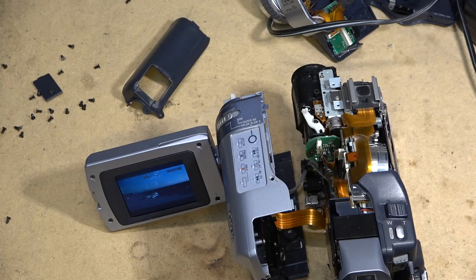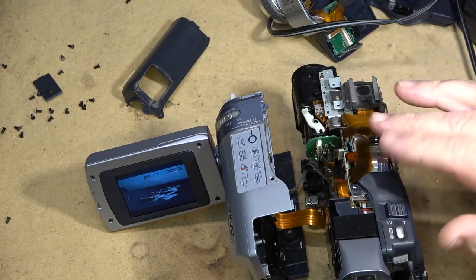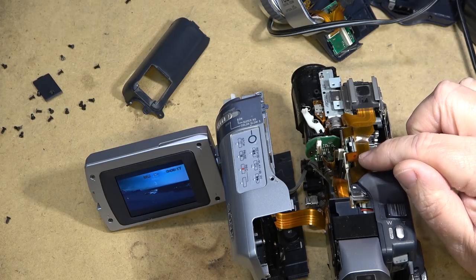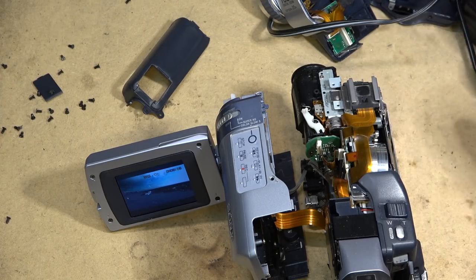And I thought the ones that I have with the little flap that flipped open on the top were bad. They were bad because with the little flap that flipped open and closed were the controls. You had your zoom control on the top. The flex cable bending back and forth all the time had a tendency to break, and then you couldn't operate the unit.